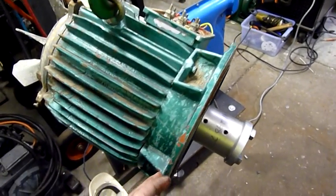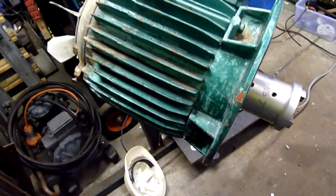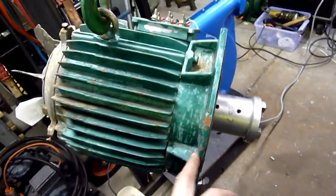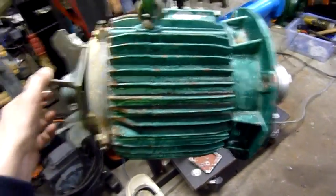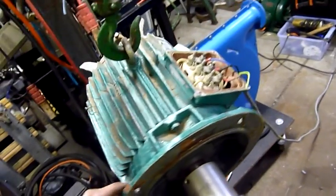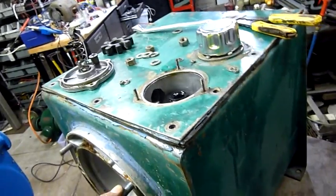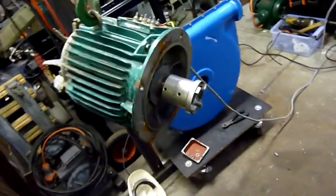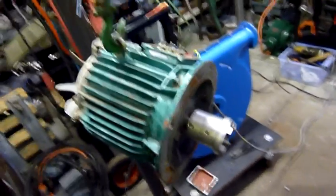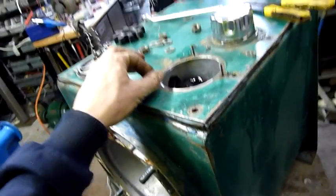The motor runs all right, but I'm more interested in hydraulic power at the moment. So we'll look at a stand-alone three-phase generator using one of my other diesel engines — even just a petrol engine. There's nothing really wrong with using a petrol engine, they just cost more to run as far as fuel's concerned, and fuel goes off a lot quicker. I don't think I'll over-complicate the build by trying to make a generator — it'd be a more stable and easier option if I build a stand-alone. At least that way the governor can be set 100% and I'm not worried about varying loads and things. So let's just focus on a hydraulic power unit and then a three-phase generator.